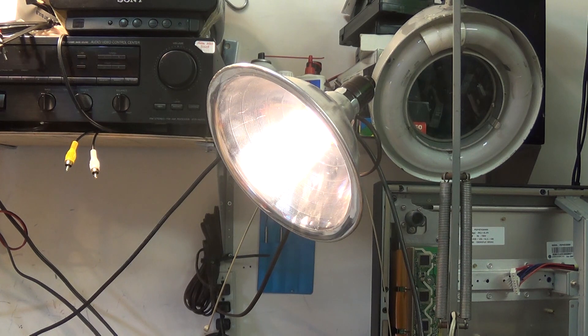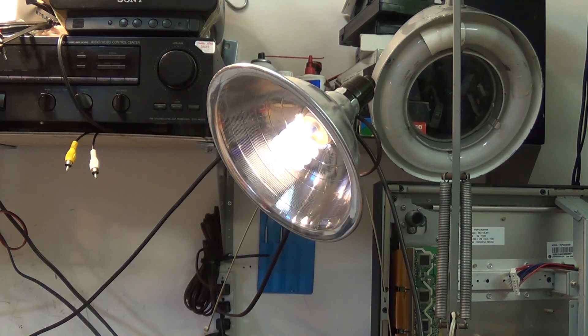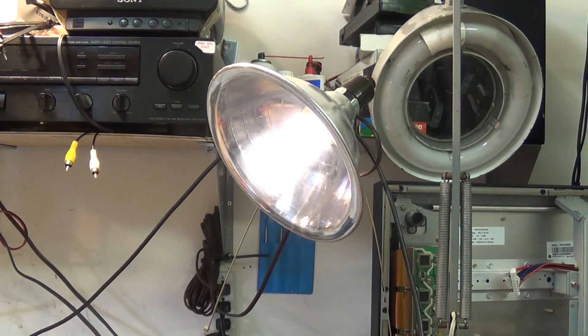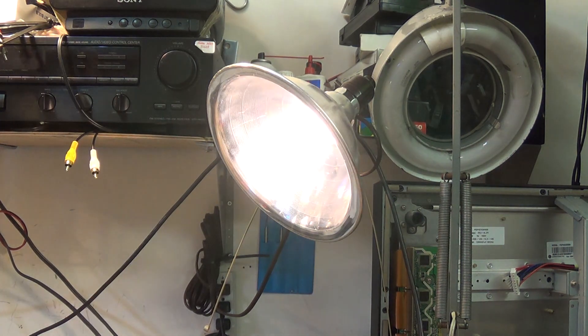If you want to wait 20 seconds for your lamp to light up, then hey, maybe that might save you $2. I wouldn't go on and say this is a really good way to repair it. This light is having trouble, and that might be because I went with a 4.7 ohm resistor instead of a 1 ohm. But this was just in the name of science — will it light or won't it? Yes it will. And now we're only working off one heater.